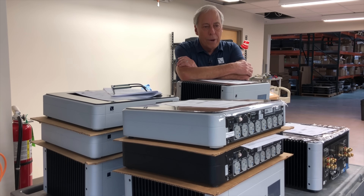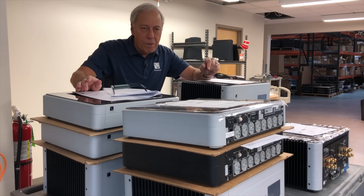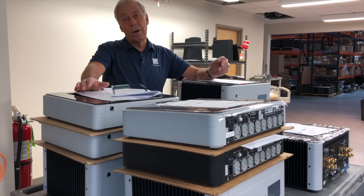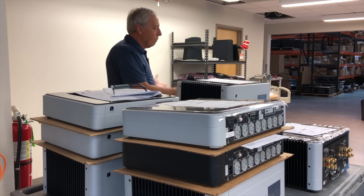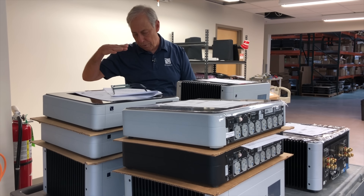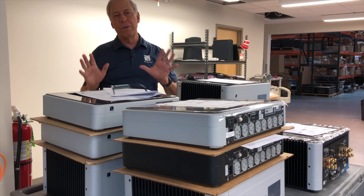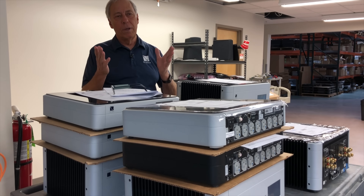You have this in-and-out process in addition to any digital process that came before, and that gets increasingly difficult to make it sound correct. I don't know of any full DSP speaker system that I would actually have in my home. What I think is the best use of DSP — which is what we'll be doing with DSP in our new speaker line — is in the lower frequencies, around 500 hertz down to 20 hertz, because those are the ones that are very problematic in rooms. But once we get into the 20 kilohertz region with very sensitive tweeters, phase shifts, and all the challenges involved, it gets very tricky to build a transparent-sounding speaker system using A to D and D to A.